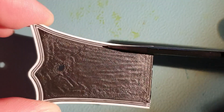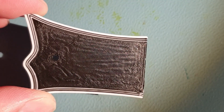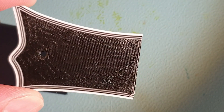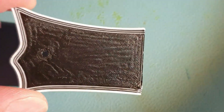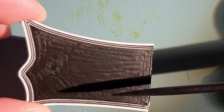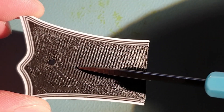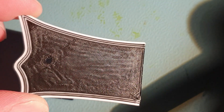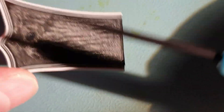This filament here and the white filament as well had flow values that I had calibrated, and during calibration they looked quite good — I thought they were good. So I had pinned those values in as perfect. But those values were really high. For this black one it was 1.097, and for the white one it was 1.06.